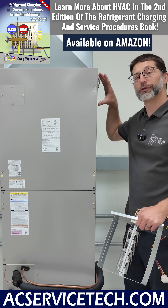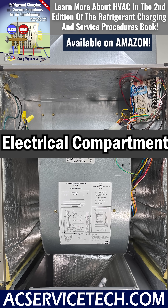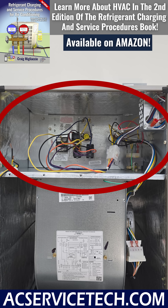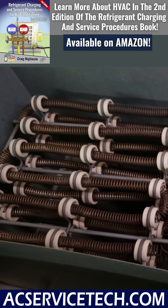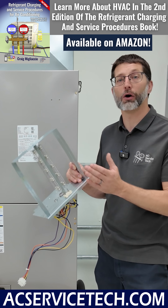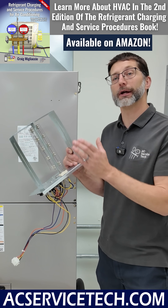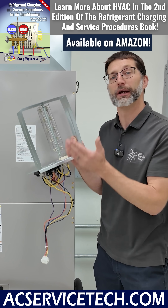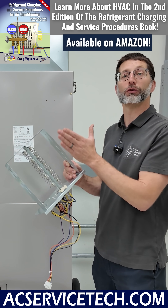There is an addition you can add in the electrical compartment. The blower wheel is here, and you'll see an electrical compartment where you may have to add electric strip heating into this unit. When working on an existing unit, before you see the blower wheel you're going to see the electric strip heater. An electric strip heater is either the primary source of heat on an air handler connected to an air conditioning system, or a backup source of heat for an air handler connected to a heat pump system. It's a direct conversion from electricity to heat, so it's not as efficient as a heat pump.